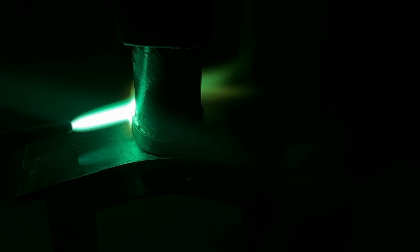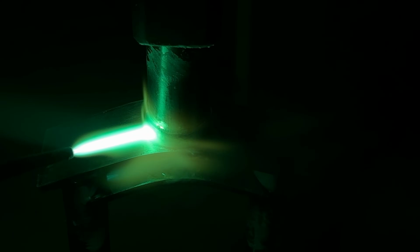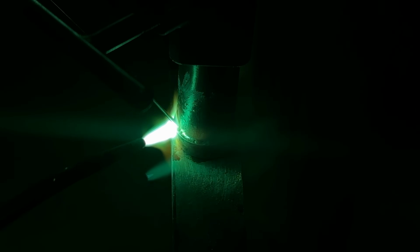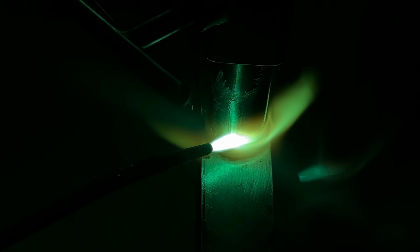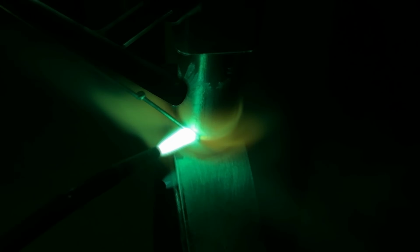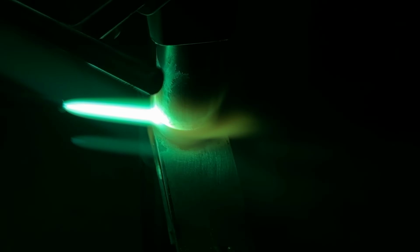Can you see where I got the cone? The cone's maybe 3/4 of an inch back, so it spreads the heat out quite nicely. And you can see the nickel silver flow. Can you see it moving along? So I heat up the crown race so that nickel silver sucks down. And then I add a bit more on the top to get a little bit of a fillet on the top. Very tiny fillet.